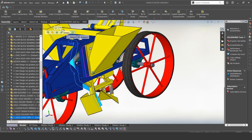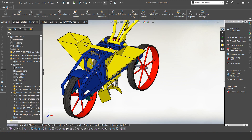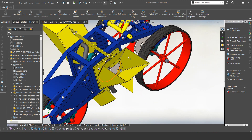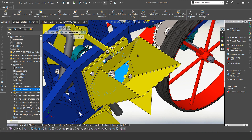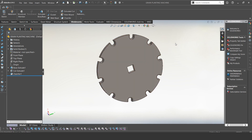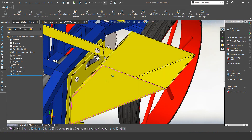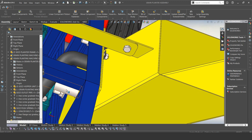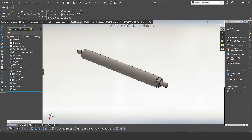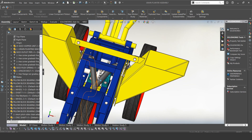We have our seed chute — this is our seed chute. It's just a rubber pipe that is connected to the seed hopper. Inside the hopper we have our seed metering system, which consists of a disc. This disc has holes around its circumference and also has a square hole in the middle, which allows attachment of the shaft. The shaft also has a square shape, which enables transfer of motion between the shaft and the disc.